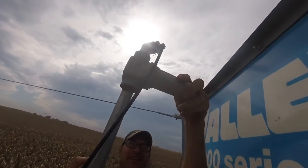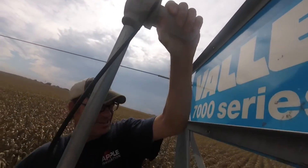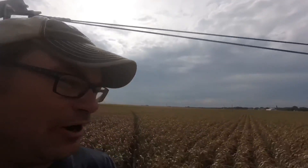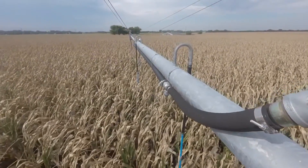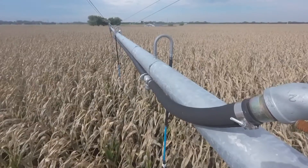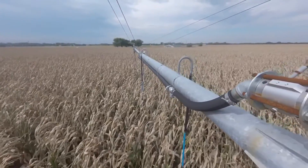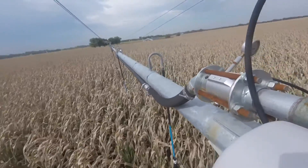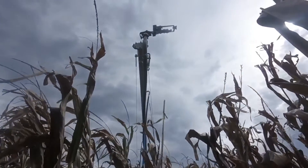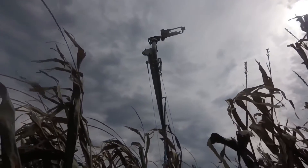The final things you need to do: there are drains on the booster pump hose — one right here and one at the far end, very similar to the tower box drains. Make sure those are clear. Also, some systems have a spray nozzle at the end of the system — you're going to want to take that spray nozzle out and make sure that it drains.